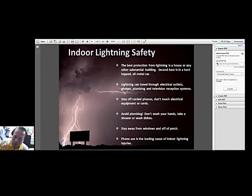There might be ground voltage levels that can appear during high voltage testing, and phase to ground voltage gradient may happen. But usually it is the result of capacitance coupling effects from the lightning protection system in industrial plant circuits. When is an ungrounded or floating system mandatory? If a ground fault occurs in an ungrounded system, shutdown is not necessary.